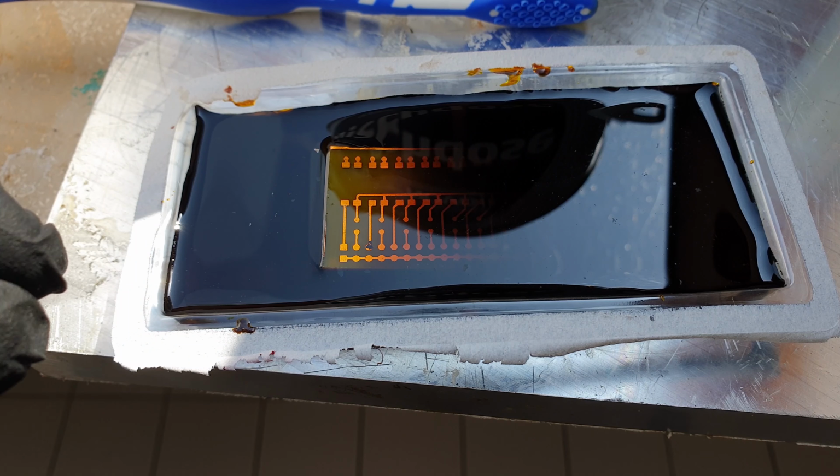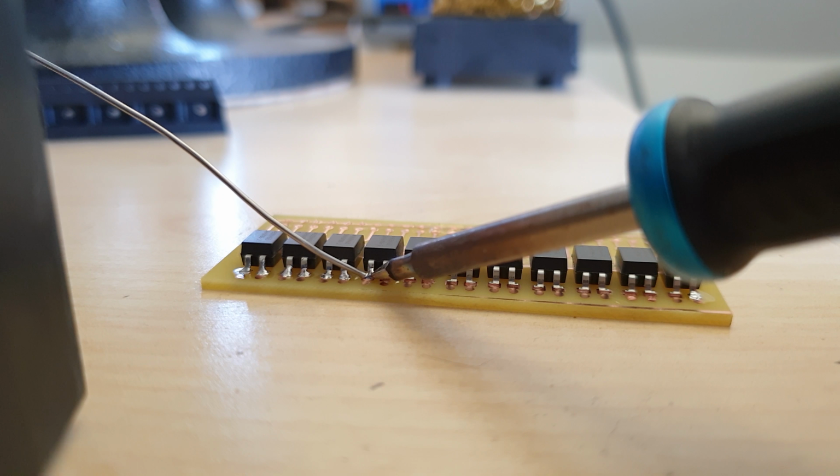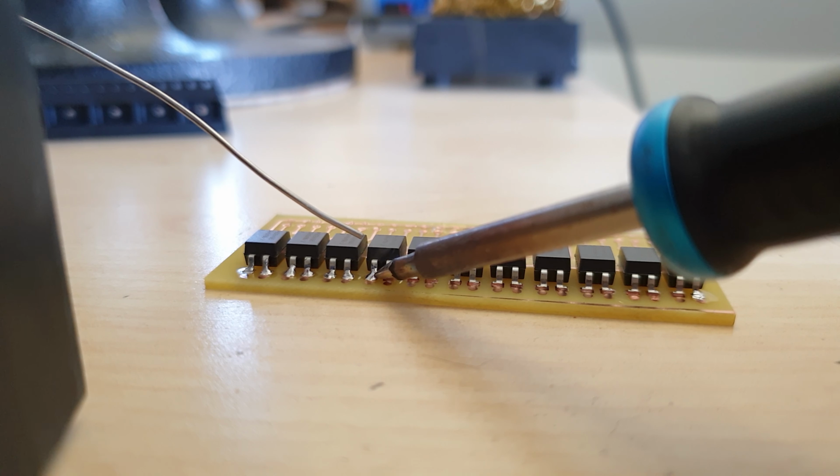It's not a crazy intricate design or anything, just some optocouplers connected to my motion controller FPGA card. I'm so making an entire video about that thing and its integration in Linux CNC. That was quite the adventure. The story behind the optocouplers is, I just want to pull low some normally high 24-volt inputs of the servo drives with the FPGA card and its 5-volt tolerant GPIO pins. And there we are, back on topic.